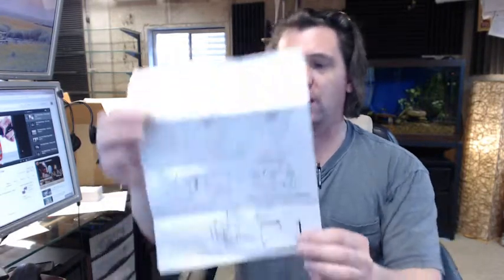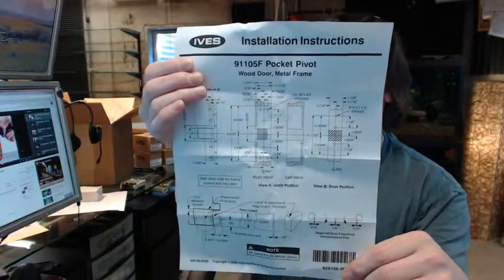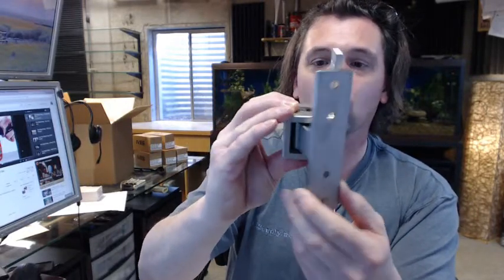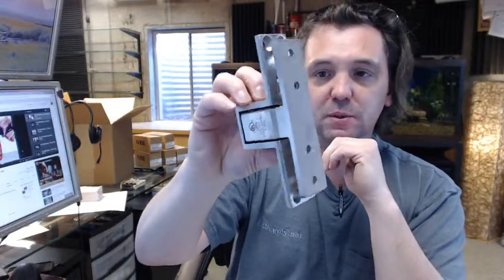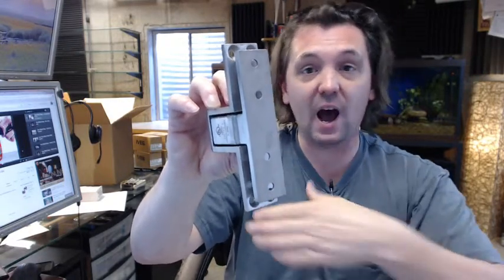All the preparations are drawn out on the template with full dimensions, so I am not going to belabor those points in this video — I just want to give you a closer look. It is available in different architectural finishes. It swings in only one direction, but it is not handed, so it can swing either way. These are large hinges; each one weighs about 2.5 pounds, so they are heavy and intended for those specific applications. That doesn't mean you cannot use them anywhere you want a hinge out of the way.